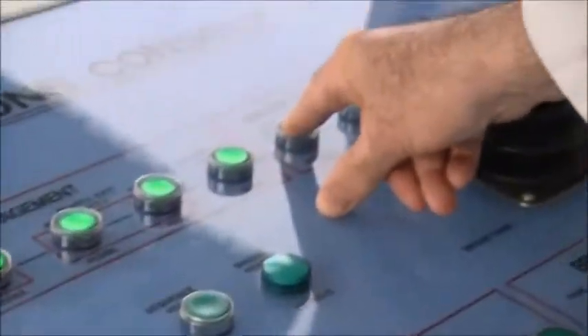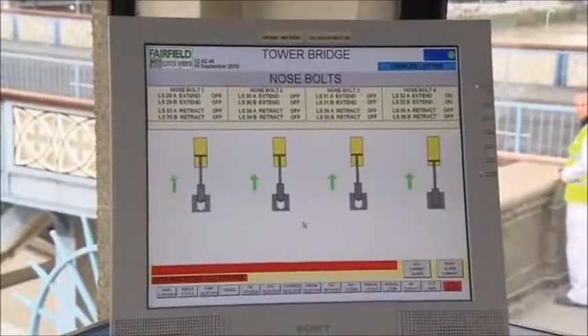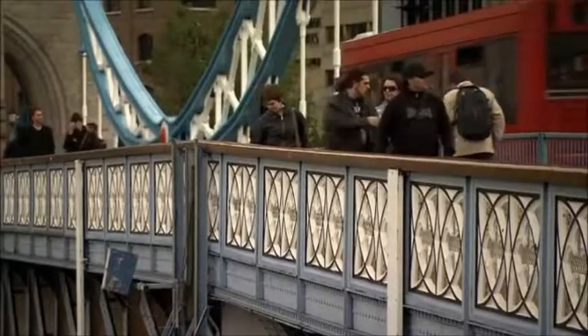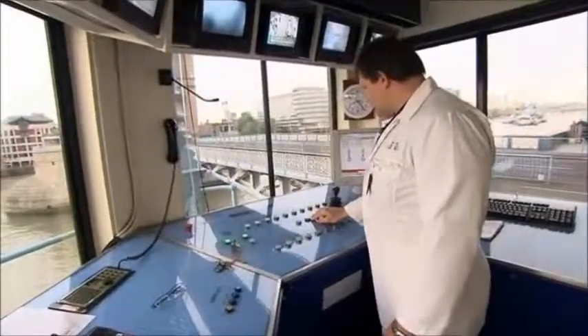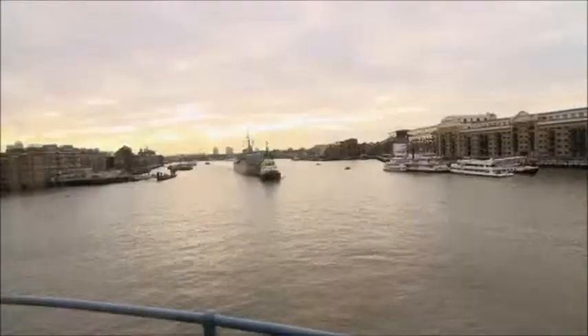So we just unlock the nose forks as well. The nose bolts are four six-inch square bolts that are hydraulically operated and lock the two centre sections of the bascule together. Nose bolts are retracted. That's the bolts disengaging.